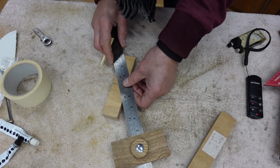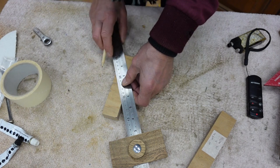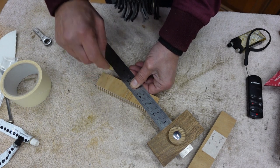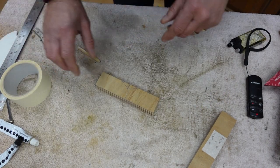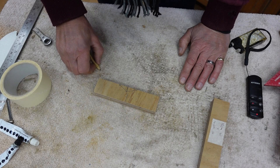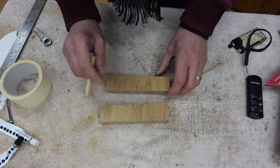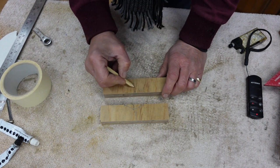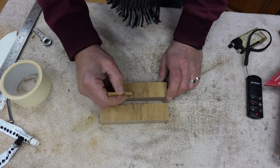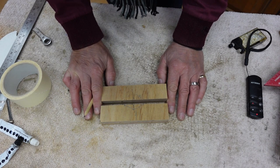Once I've got that shape, I want to cut out an angle with my original machine. I made a round cut, but just feel like maybe an angle might be a little bit better, because being an angle, when you've got a circle, it's when I'm compressing both sides like this, you got 4 points of contact. One there, one there, one there, one there. Whereas with the circle cut, you've only got a little bit on the top and a little bit on the bottom. That's my understanding of it. So I think this will be an improvement anyway.